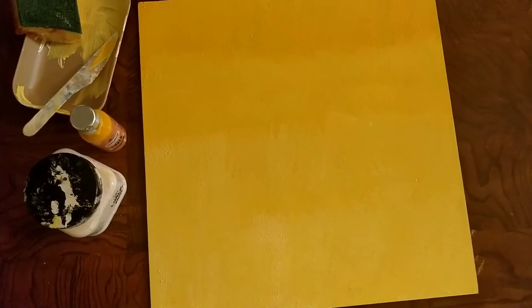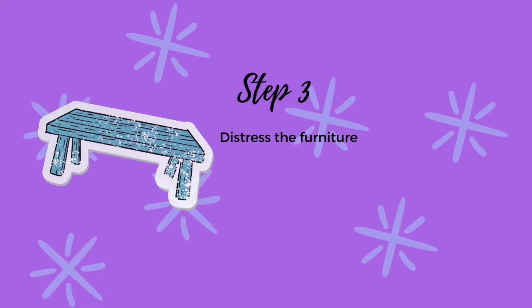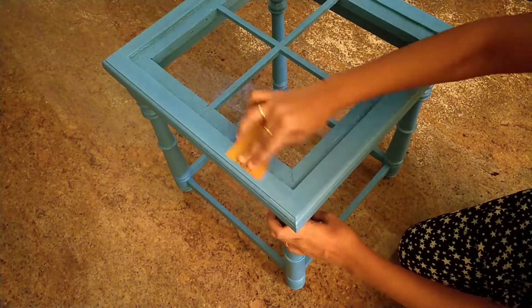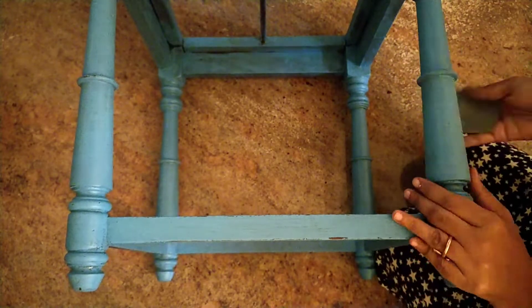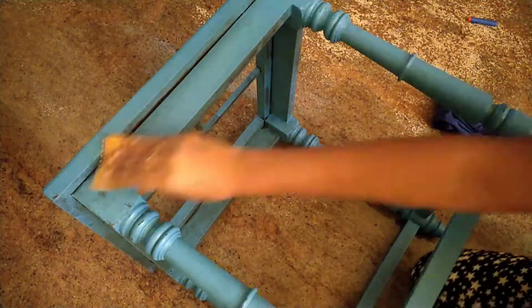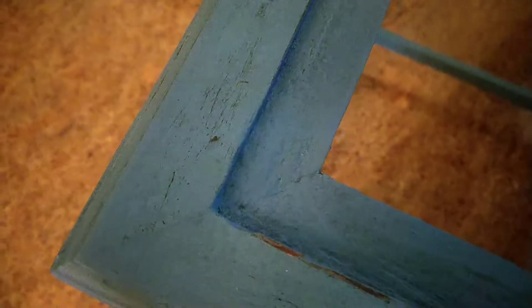I'm really happy with the way this has turned out. Our next step is to distress the furniture. If you like the clean look of your furniture you can ignore this step, but I think it really adds some character. For this we first start with smooth to medium texture sandpaper and we're just going to roughen up the texture — we don't want to rub too hard because that can cause the paint to chip out. Next I'm going to go in with the coarse sandpaper, and at this point I really want to be rough and I want the wood to come through at certain points. This gives it a nice vintage, almost withered look which I really love.